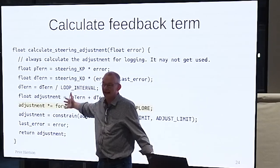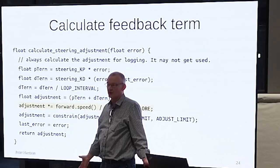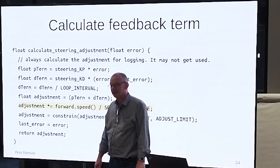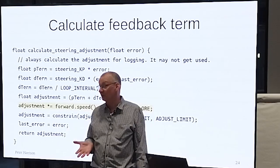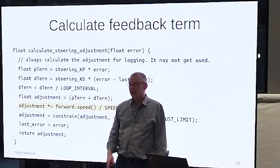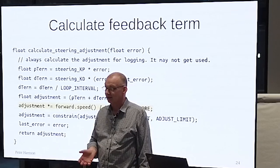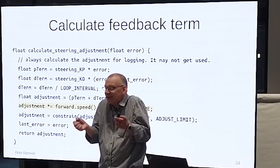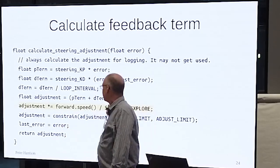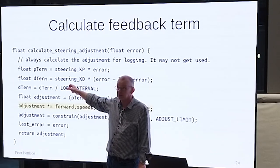So you might get a number that's like 3,000 instead of 3, and you can't work out why. It's nonsense. If it's a one millisecond cycle time, they've done it in their sums because they were taught badly how to do it. It says you increase your P term till you get some oscillation, back it off, increase your D term. We talked about all this before in an evening session, but it means nothing if you're not correcting for the loop interval.